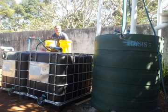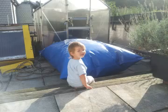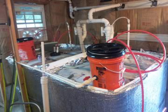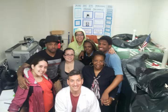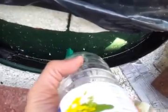This digester doesn't store gas, so for that you'll need some other form of storage. We tend to use PVC balloons or bladders — plastic bags connected to the tank with clear plastic tubing — and they work just fine. In New York, we've built these digesters in two family basements, with gas stored outside in bags connected by a T-line to the kitchen stove. Biodigesters are perfectly safe to use in the home and are generally odorless if fed correctly. If you want to ensure there are never any smells from the pipes, pour a thin sheen of vegetable oil or citronella in the feeding and outflow pipes every couple of weeks and lightly cap them.